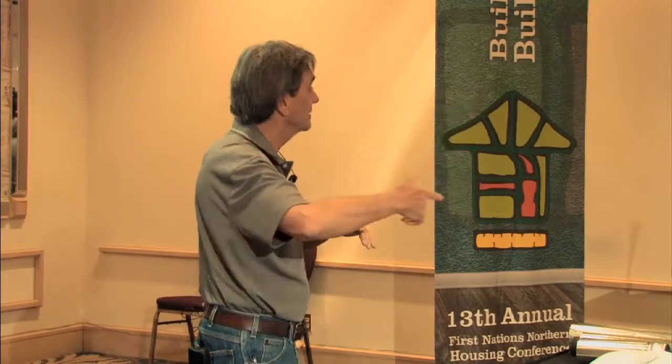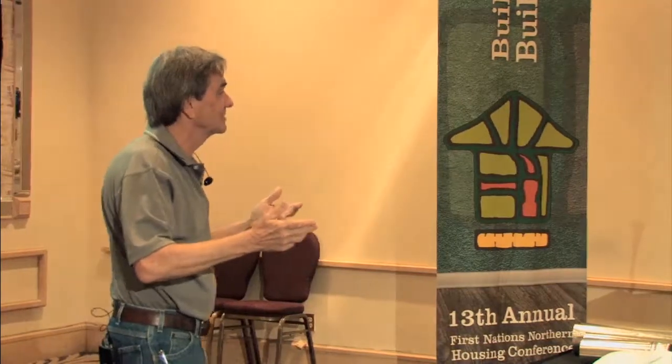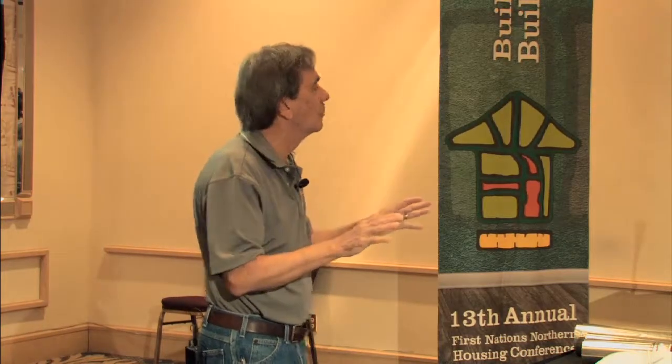By the way, when you do have forced air heating, one of the things I always tell consumers, and this would be very good to build into your rental houses, is that you usually have balancing dampers down in the basement near the heating system. As the duct branches go out, there's a damper in the middle of it with a little handle on the side. Theoretically, those should be set differently in the summer and the winter, particularly if you're using the ductwork for your HRV.